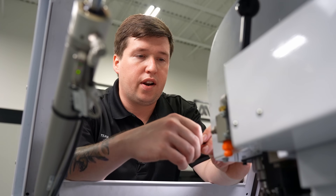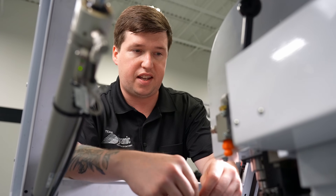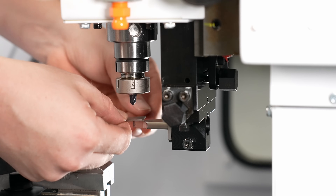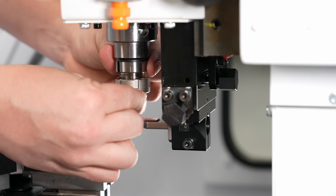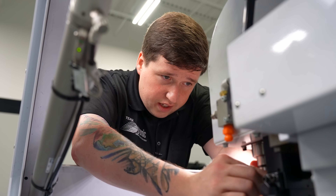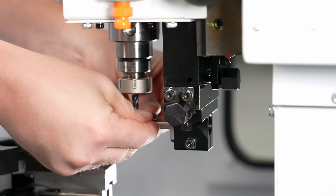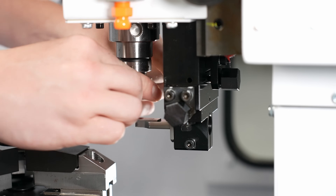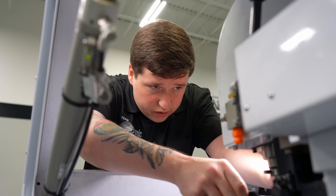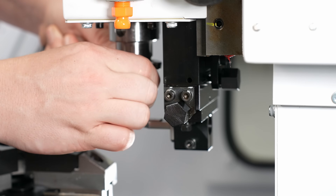You might be wondering how do we set the height of our chamfer mill consistently. The answer is shim. I'm going to set this 50-thousandths shim on my stylus, and then I'm going to break loose the chamfer mill and it will simply drop to my shim. Then all that's left to do is tighten it. You don't have to use a 50-thousandths shim — you can use any size shim you want, as long as you're consistent. Then get the proper spanner wrenches and tighten the cap that holds your tool, and remove your shim.